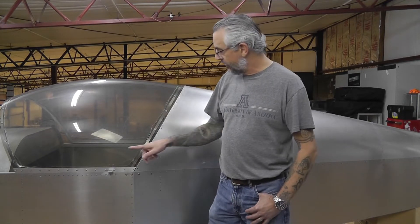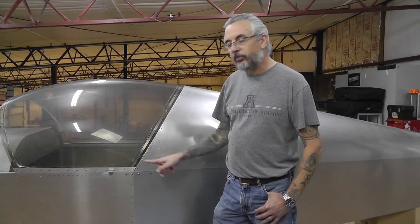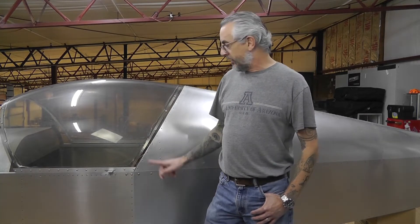No blame being laid here. But there's a couple other problems — also in some of the pulley systems for the control cables. There's one I want to redo because the pulley is drilled at a little angle and it rubs on one side of the support. Not a huge deal, but over time could wear and cause a problem, so I want to redo that.